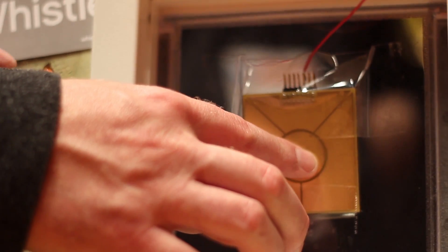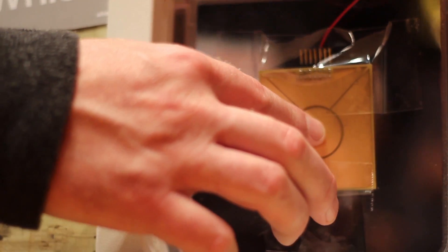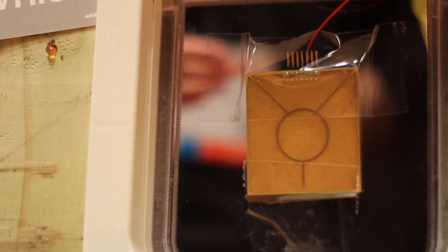The way we know that your cat wants to come in is because it puts its paw on our capacitive sensor. We're actually quite proud of the capacitive sensor, because the K64 doesn't have a capacitive sensor peripheral, so we used an RC circuit to detect that you're basically introducing capacitance to ground with your body. Once you get that, we end up sending a message to a chat service and let the iPhone know that the cat wants to come in.